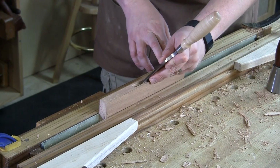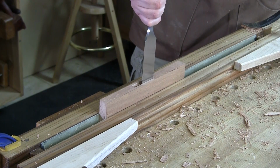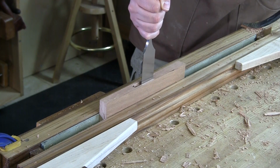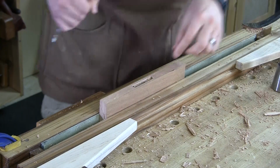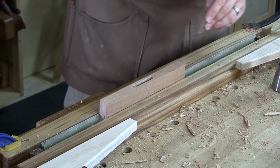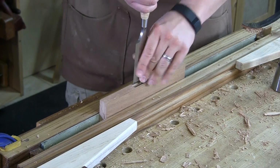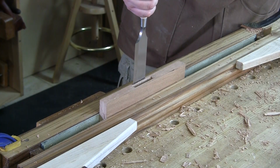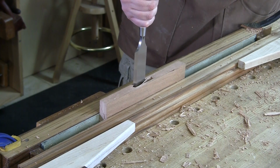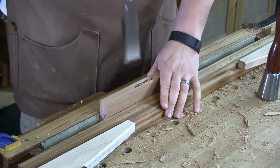Now as I put my chisel right on my knife line, step back and sight down, just some light taps, and you should feel it break through as it goes to the other side. It connects up with your other chisel, and that's the indicator that you've got it square, straight up and down and plumb. If it continues to pose resistance all the way through to the other side, you're probably undercutting, or maybe you undercut the other side. And there we go. It pops through.